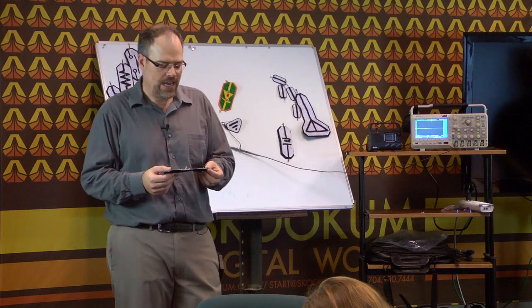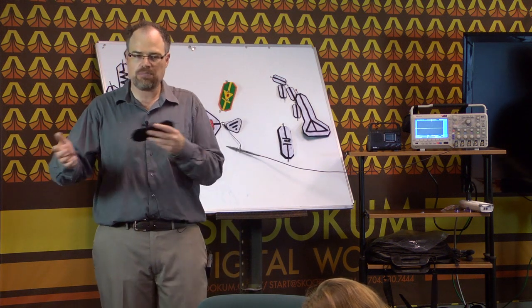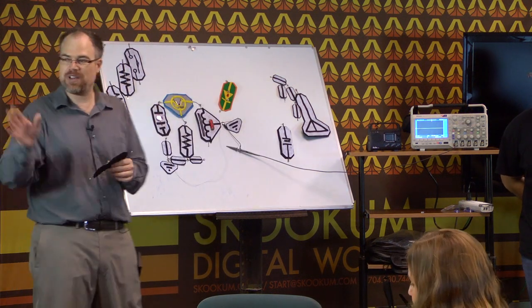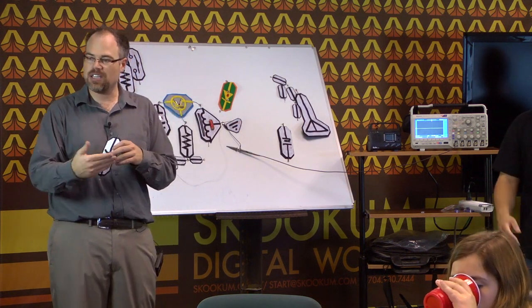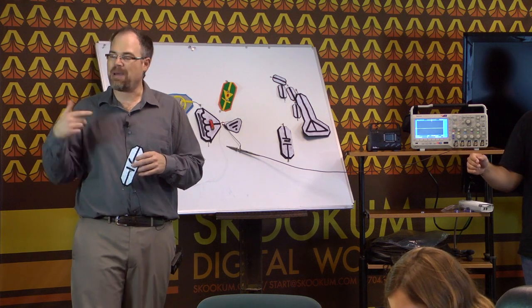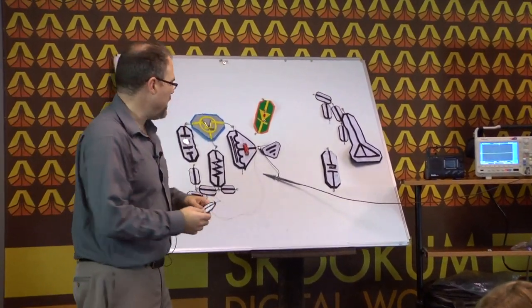And so it's shown with an isolation, and it is an isolation. But interesting things happen. It creates this interesting way in which signals can be passed from one part of a circuit to another part of a circuit without undue influence on the circuit. So we just want the signal. We don't want the other aspects that are going on. It's like buying a company out of bankruptcy. You just want the assets. You don't want all the liabilities. And so this creates an insulator that allows you to get the signal you want without creating the drain and the path to ground, because that's a problem. If you create a path to ground, all of your electrons will just leak out, right? So we have here a pretty good path to ground in our coil, and we want to protect ourselves from that.